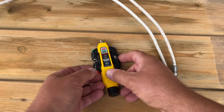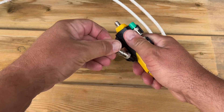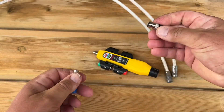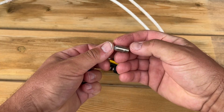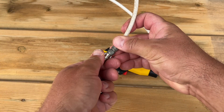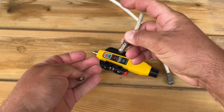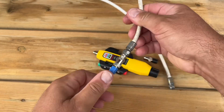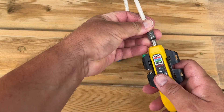This is a nice easy tool to use to test the cable. Just going to remove these remote test leads from the onboard storage — I'm going to use just one of them. It does come with a barrel adapter to connect it to one end of the coax cable. Just twist that in there, push the remote test lead on to one end of the cable, and the other end of the cable gets connected to the tester.